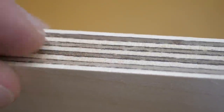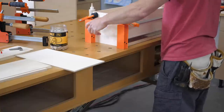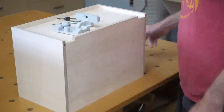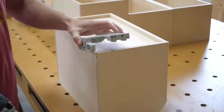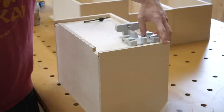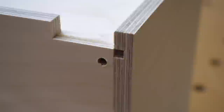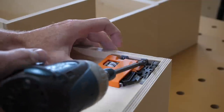And here's a quick look at the glorious results. Next up, I need to drill some specifically placed holes in the drawer box. The hole on the back registers a pin on the drawer slide and keeps the drawer box aligned on the slide. These two teeny tiny pilot holes are to hold the clickers in place — the clickers allow for quick installation and removal of the drawer box and have some left-right adjustability built into them.